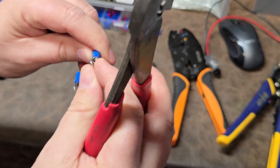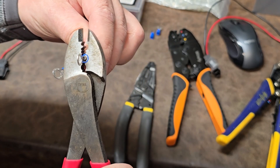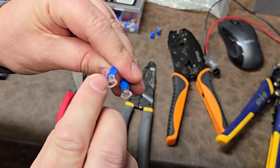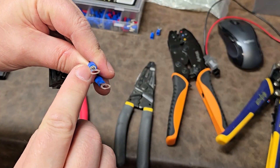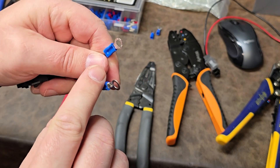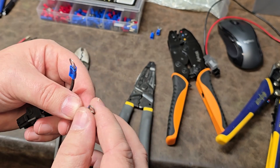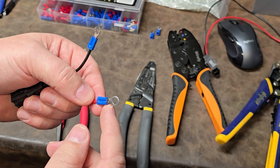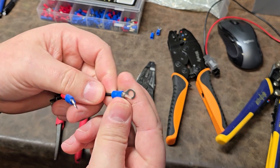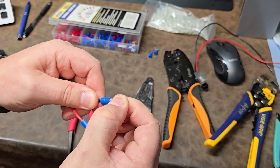The better way to handle this is when you put your wire into the crimp, make sure that it is inverse of your pliers. I'm actually crimping on the opposite side of that little slit. What it does is it squishes the wire to both sides and fills it in much better. There are no spaces, no cavities, no hot spots. Versus the wrong way, you can see there are some cavities and it starts splitting the connector apart. The correct way, crimped on the back side, actually squishes it tighter together. When you have spaces, that's when wires expand and contract — because that's thermally what happens when you put amperage through wires, they get warm. They'll work themselves loose and you'll get connectors falling off, like you've just seen at that control center. This one here is crimped pretty good — there are no spaces in there. It's a very secure connection. It ain't going nowhere.